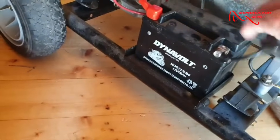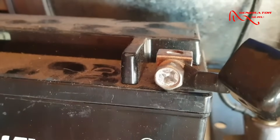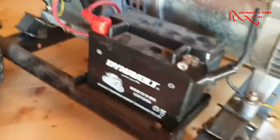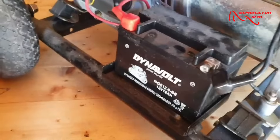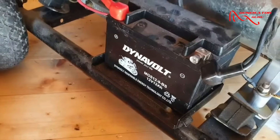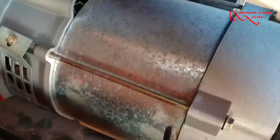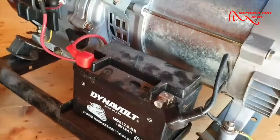In most cases you're going to need a Phillips or crosshead screwdriver. You may also need a spanner or wrench — 10 millimetre, as almost all batteries on small engines and generators are 10 mil. All generators are metric these days, and it's worth having the right size, because trying to replace some nuts and bolts — especially on the alternator — is very hard if you cross that head.